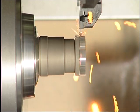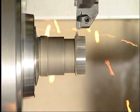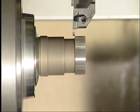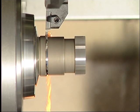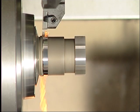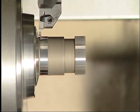We start with side turning — an interrupted cut with a form-cut radius insert. In the next step, you will see the great advantage of the form-cut grooving system in matters of process reliability: side turning in continuous cut, then face turning in interrupted cut with a change of direction of the cutting forces, while the position of the cutting edge remains unchanged.